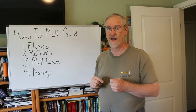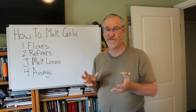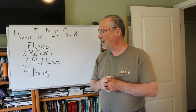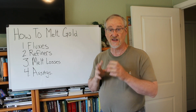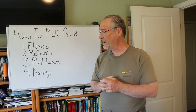What I want to recommend is that you never send a refiner a package of fines, even if you saved it up for years and you had 10 or 15 ounces of placer fines and other fine gold that you have accumulated. It's just not a good idea to send it to a refiner directly that way. What I recommend is that you melt it and consolidate it into one piece, a bar or whatever shape. It doesn't make a difference whether it's cone shaped or bar shaped. The refiner is perfectly happy to deal with it, and you send it to them in that form.